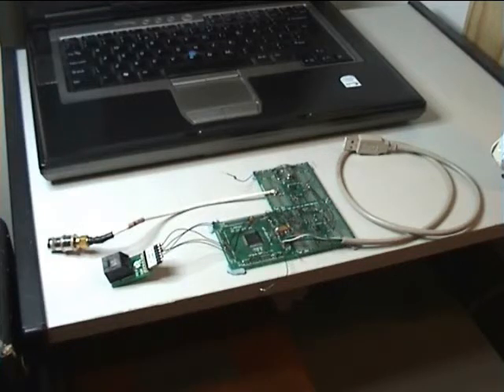This covers from around 65 MHz all the way up to 1.7 GHz. Now of course this is in a prototype stage, as I'm sure you can see, but the fundamental parts here are: you can see on the left a BNC connector — that's your RF-in — and towards the right there's a USB connector.